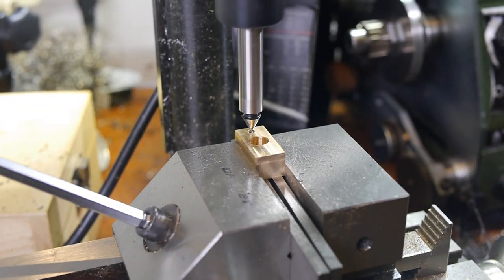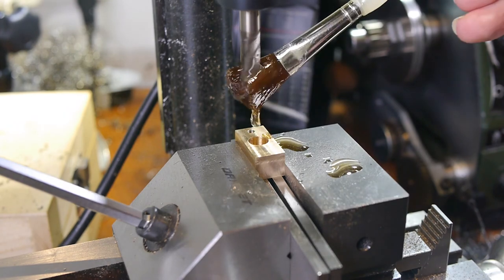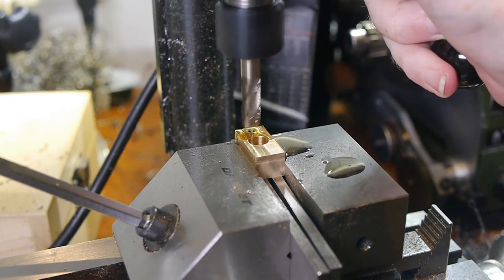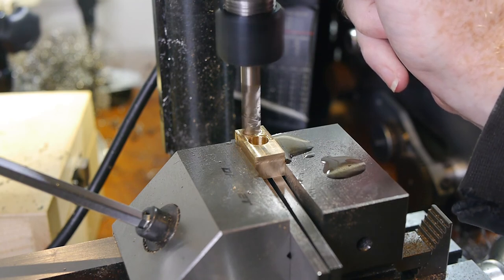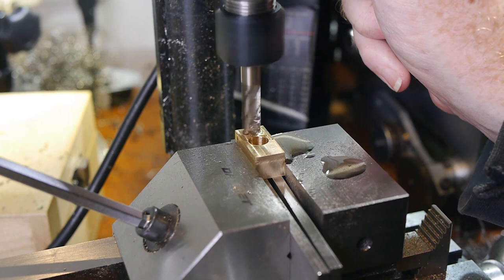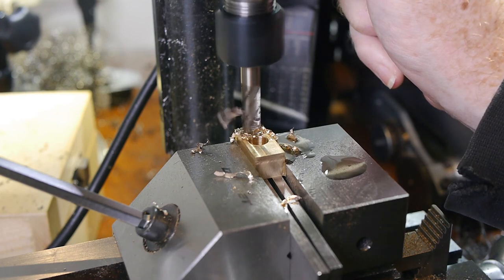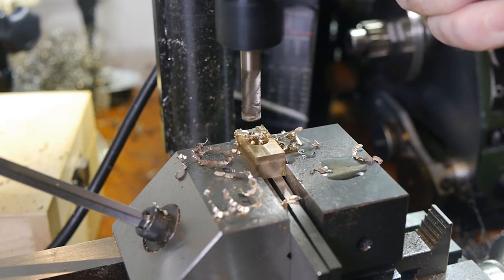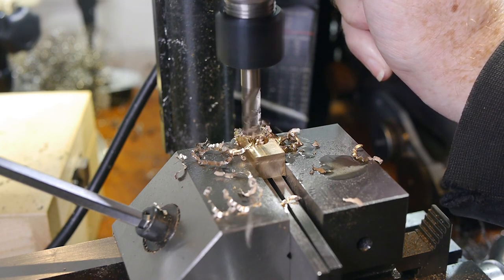The final counterbore was the housing for the thumb wheel at the back of the lower jaw. I used a center finder to relocate the hole, as the mill column had been moved in the meantime and my reference table position was no longer useful. The tool tended to grab even more than before, probably because the cut is somewhat intermittent, as the circumference is intentionally partly outside the part.